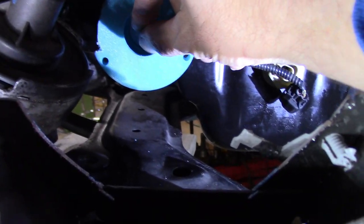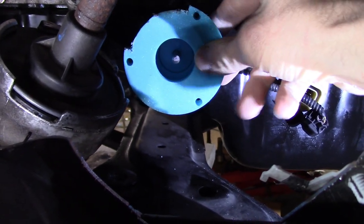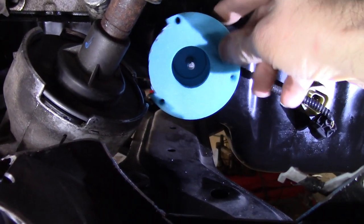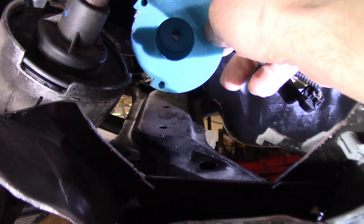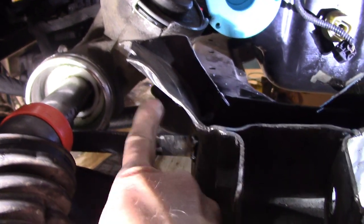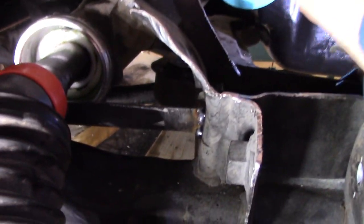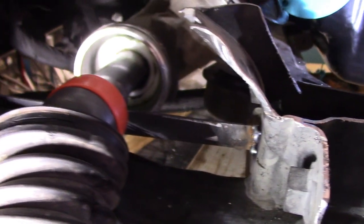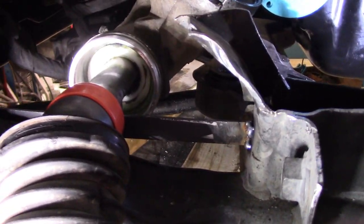Here's the quarter-inch rod coming through the oil pan, and here is my adjustable-length 3D printed bearing holder. I'm going to adjust this length so that it's behind the bulbous section of the rack. I've welded in these slides so I can adjust the rack back and forth and its angle, while at least attempting to keep the height correct for bump steer purposes. Otherwise I was just floating in space without a frame of reference.